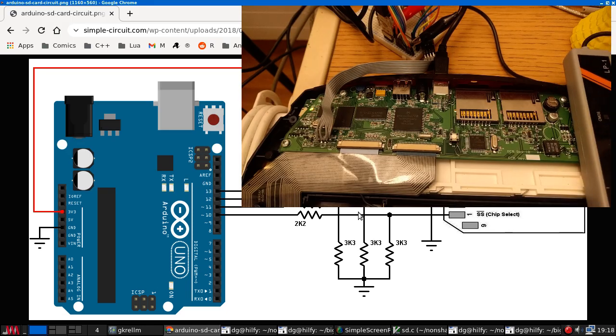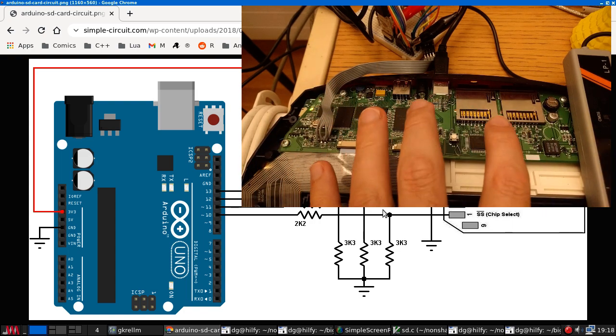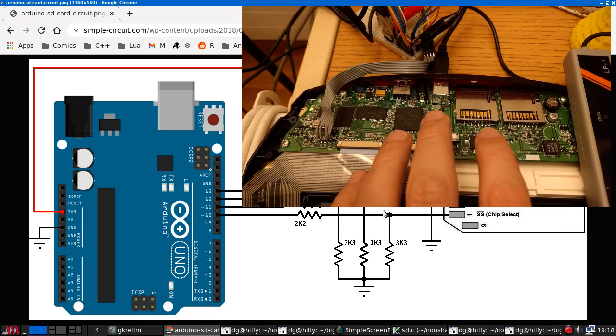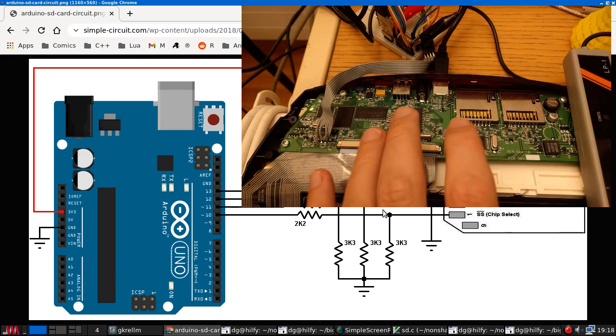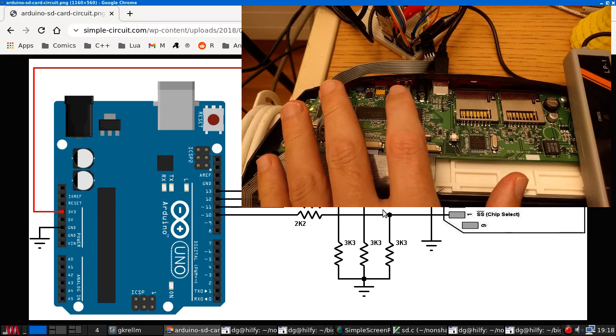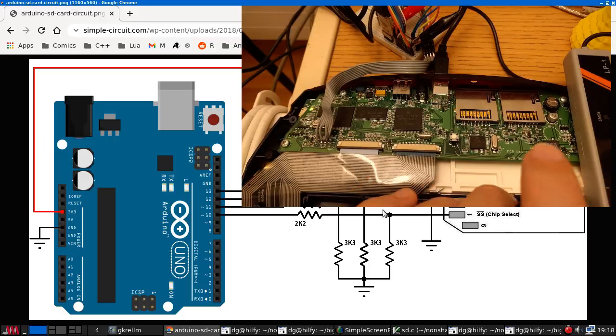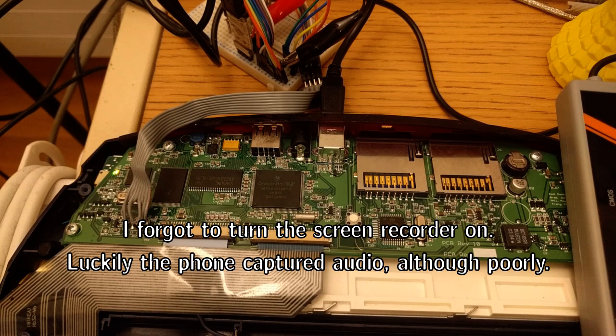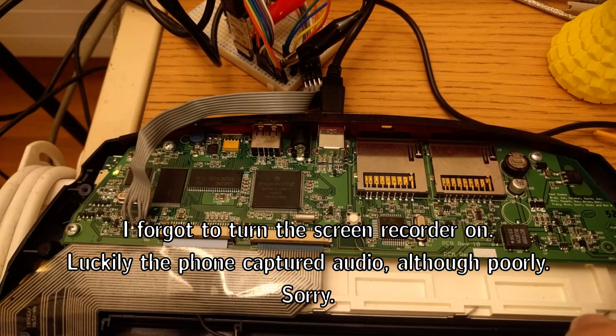So what we're going to do is poke the card and see if there's any activity on the lines. What's almost certainly happened is that PalmOS has set up the hardware in a weird state, which my initialization code is failing to correct. So it's likely to be something as simple as the clock's wrong, or the pins aren't wired up to the GPIOs properly, or stuff like that. So we're just going to poke the card by doing DIRs while looking at the various data lines and seeing what happens.